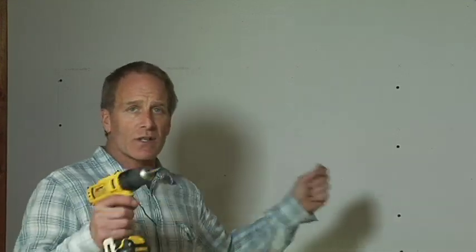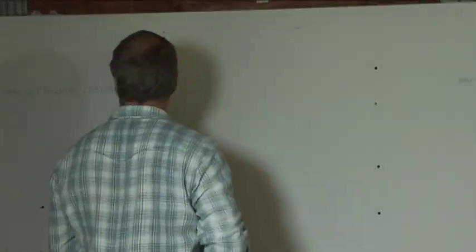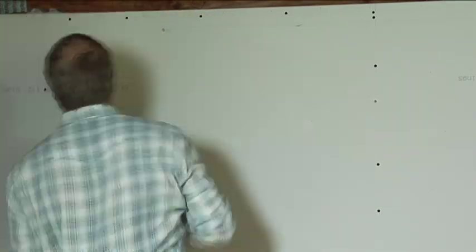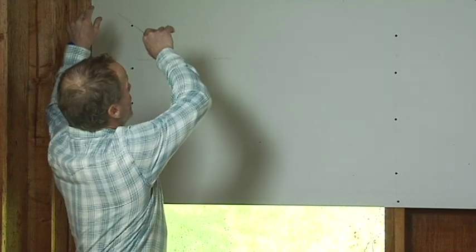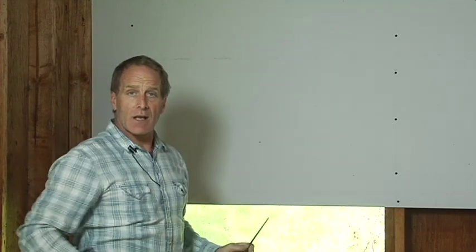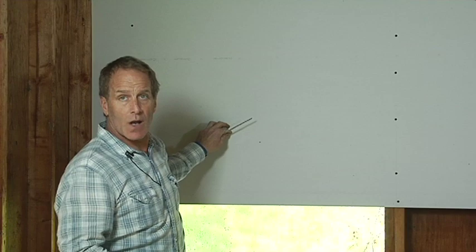What I'm doing now is screwing off the doorway. I want to do that because I don't want the sheetrock moving around when I cut the opening out. Then I'm going to come back and cut out the door. I'll cut right up here on both sides all the way up to the header, then make a line from the top of one cut straight across to the other. I'll take a knife and cut that, then go on the backside just like we did before — cut the backside and we'll have a doorway again.